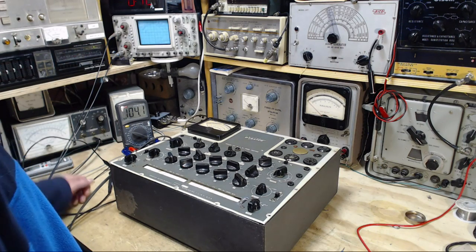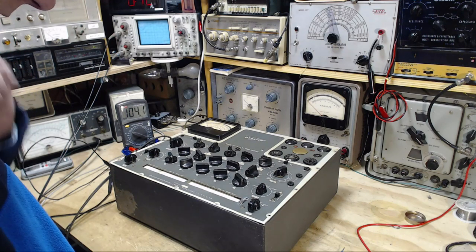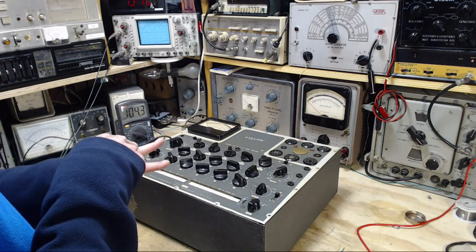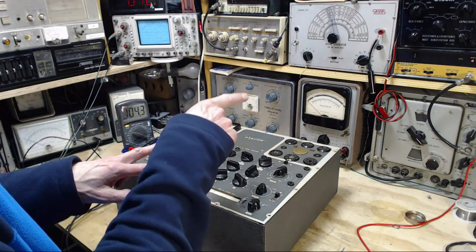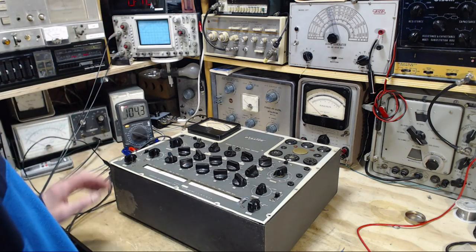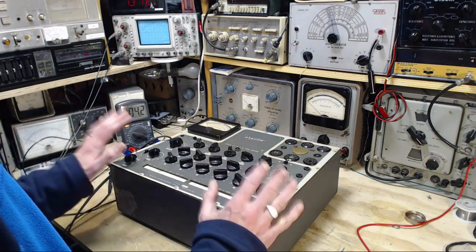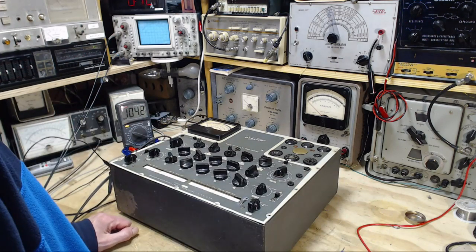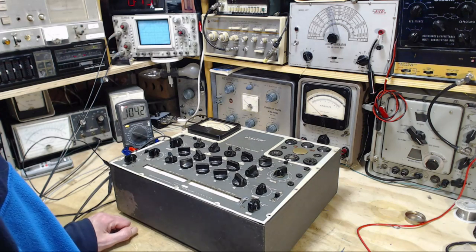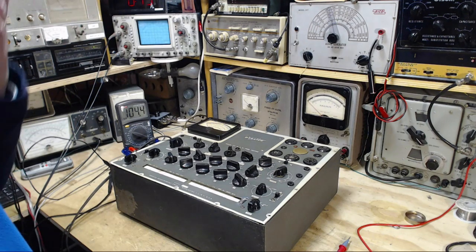Should turn the unit on and see what happens. With the switch open, the energy from the power line still gets all the way through everything, right back to the other side of the switch. So turning things off doesn't necessarily ensure that you can't have a case voltage. No, not at all. In fact, it's possible for some of these things that when you turn them on, you won't read the case voltage, and when you turn them off, you will. Maybe not this kind of machine because it has a big transformer in it.